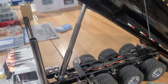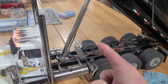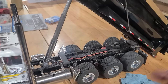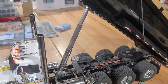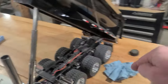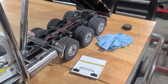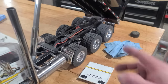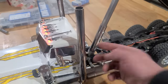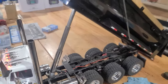It's just a gear pump — there's no valve locking it up. The bi-directional pump pumps it up, and to lower it down it sucks the hydraulic oil back out. If it gets any air in the system it gets jerky, and after running it a while the air gets worked back out. The only other thing that works is to take the cylinder completely out, point it down, hang it off the side of the truck, and cycle it in and out — that way the air runs to the port at the top so it can work its way out. That's the only way to get the air completely worked out of the system.